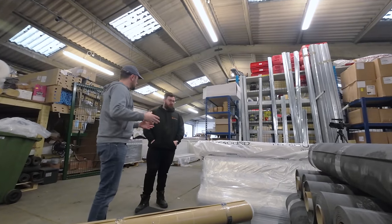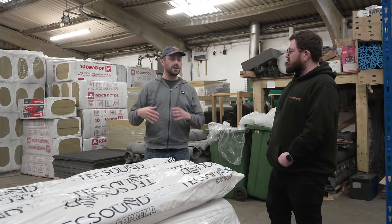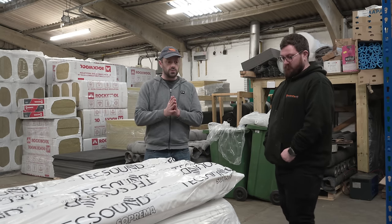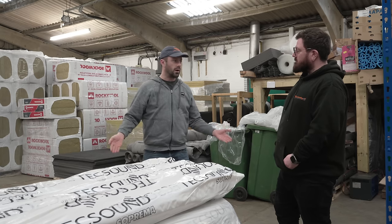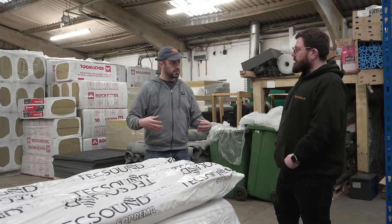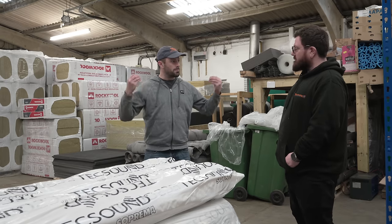The engine bay is in the main cabin, and that of course means it's a one and a half litre diesel. It's a pretty well-marinised engine, but it's still pretty noisy, and so you can do a pretty good job with basic bay lining with cheaper foams and that sort of thing, but I just realised that it's nowhere near up to the job of dampening, particularly the low frequencies. So I've spoken to my brother, who's a marine engineer, and he just says you just need mass.